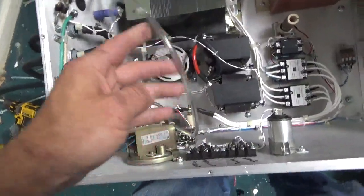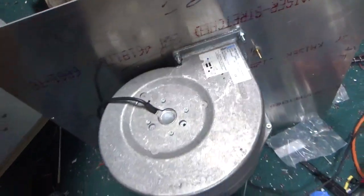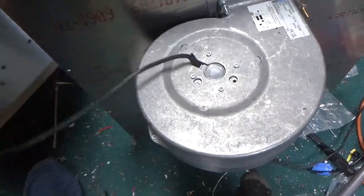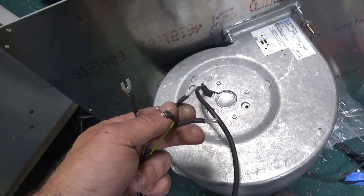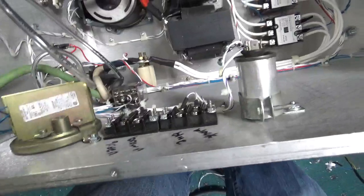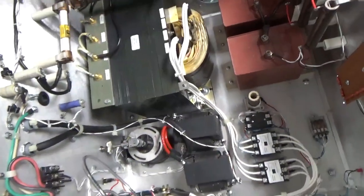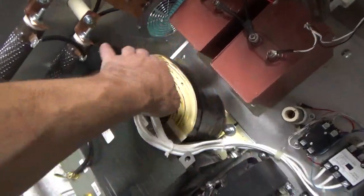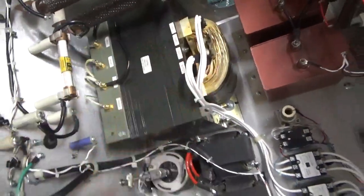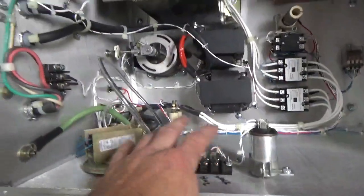I'm going to cut it to length and that will connect to the barb fitting that protrudes up into the bottom of the RF deck. Got the connections on the blower — crimped and soldered, heat shrink. They connect over here with plenty of slack so you can take the cover off and place it on the side. I'll have to do a final hardware check and replace hardware once I have it tapped, and add some split washers under these terminal strips.